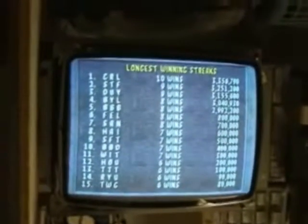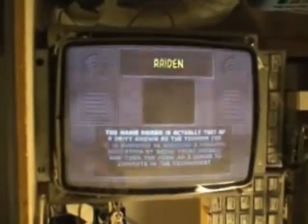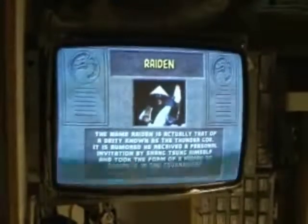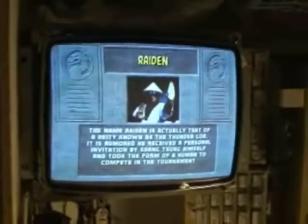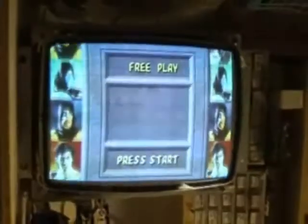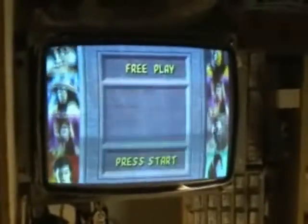So I took it off the heat sink so I could get to it, and come to find out the insulator was not installed correctly. Q901 was grounding out. So I fixed the transistor, put the insulator back like it was supposed to, and put it all back on the tube and fired it up — but I could not adjust my B+.